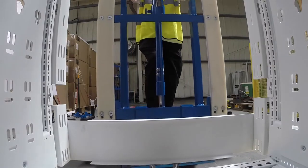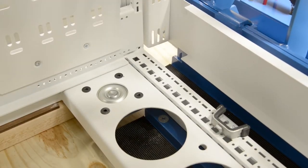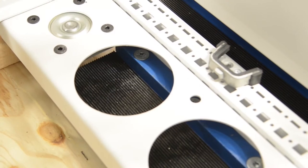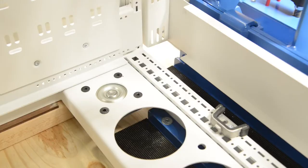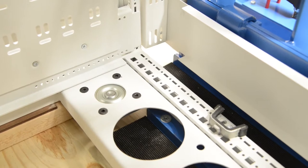Push the scoots unit towards the load and ensure the tow plate is inserted between the transportation pallet and the middle of the underside of the data enclosure. Ensure that the tow plate bar is located behind the data enclosure chassis. If necessary, use the jack to raise the tow plate slightly to engage the tow plate bar securely behind the chassis plate.